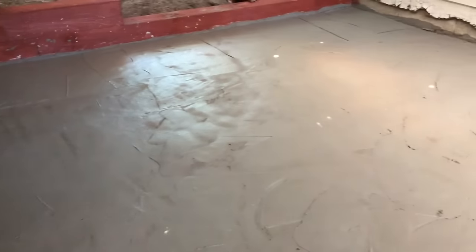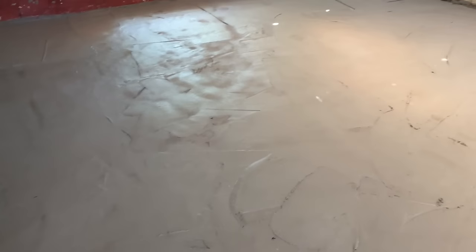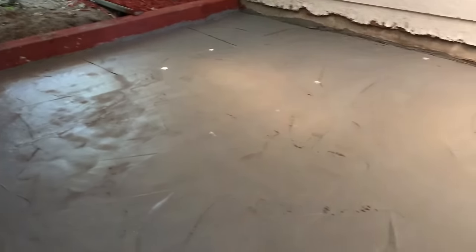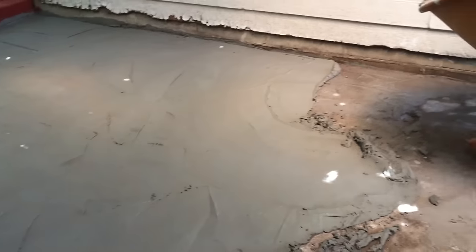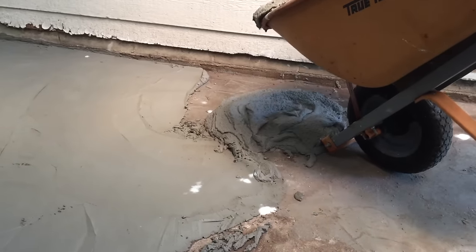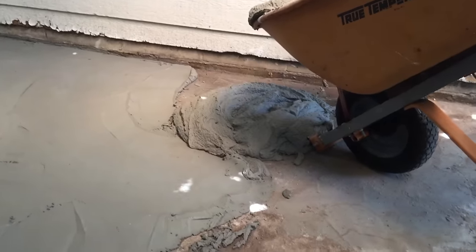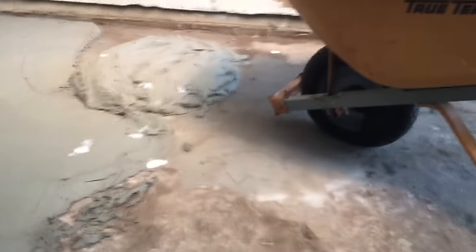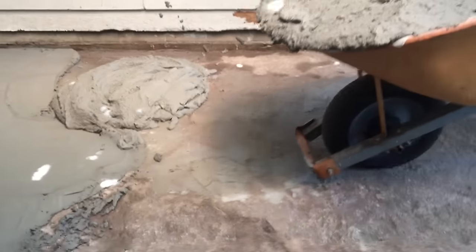Here we are about halfway done — we've gone about a quarter inch in most places, and in some spots that are a little lower there will be a half inch or so. These trowel marks you don't have to worry about because they will broom off as long as you give it a broom finish before it hardens completely. Here's our final load — you can see the consistency as it slops around — and then we just shovel it around and use the trowels to smooth it out.